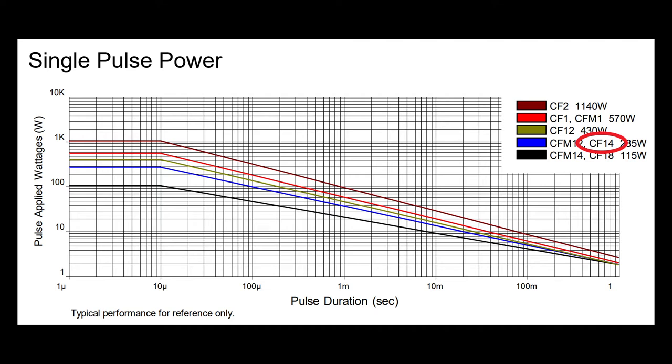The thing to take away here is if you burn 1 watt for 1 minute and then turn it off for 3 minutes, that's technically a 0.25 watt average over 4 minutes. But it'll burn up a few seconds into the first minute, because 1 minute is way too long to sustain an overload like that. This graph tells me that what I did that night, burning about 2 watts in each resistor for about 2 seconds, was way too hard for the resistors to handle. I should have consulted this graph before trying to use that light bulb.